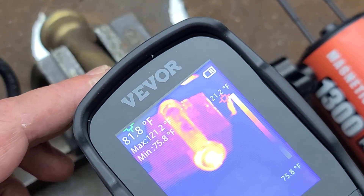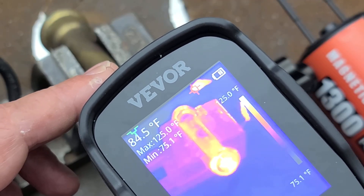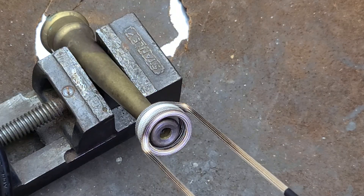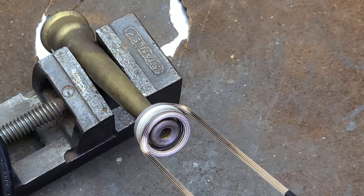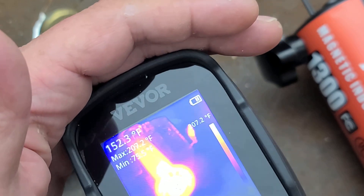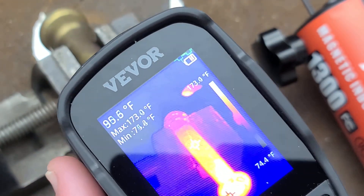On the last part of this, I decided I will try it on brass. Brass has a little bit lower resistance, and just about anything that's conductive can be induction heated — it's just that magnetic materials are optimal. I got that about 85 degrees and I'm just going to hold this on for a few seconds. I'll only give it about 15 seconds. A piece of steel would have heated up pretty darn quickly, but this — as we can see — it's over 200 degrees. So in that short amount of time, it is inductively heating this non-magnetic material, though you'll have widely varying levels of performance.